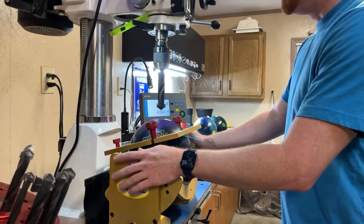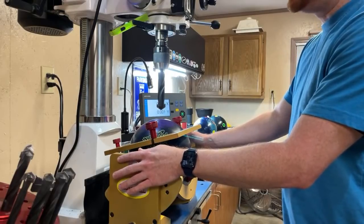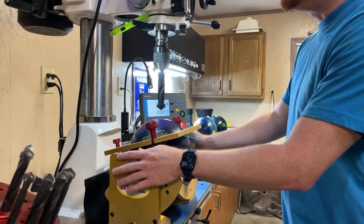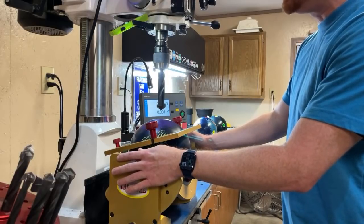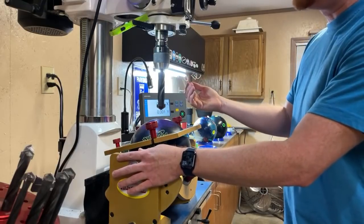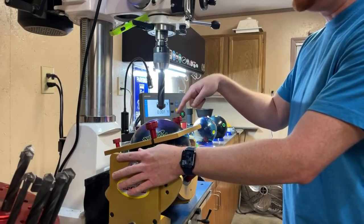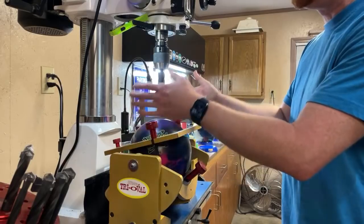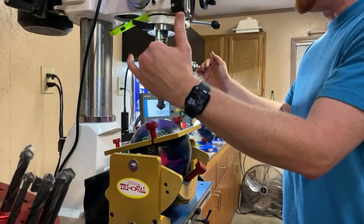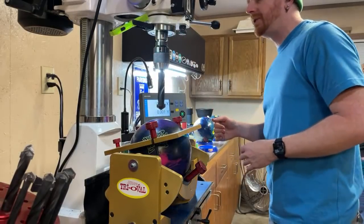However, to make this work out easier, generally I drill out the slug faster because the slug material is softer than the ball is. So by going faster, the walls of the ball will actually divert the bit ever so slightly into the softer area of the slug. So if it's even just the slightest bit one way or the other, going faster will kind of push the bit into the softer material of the slug.